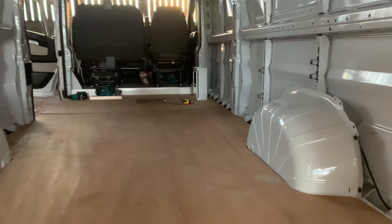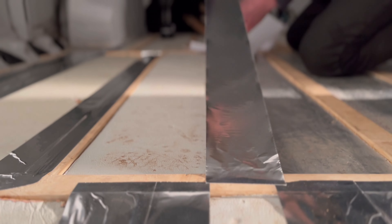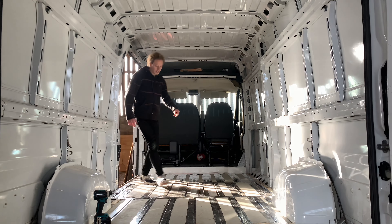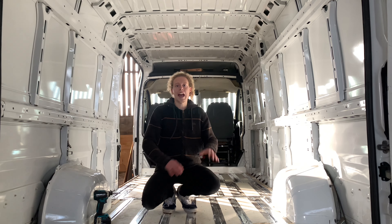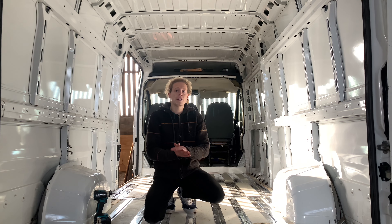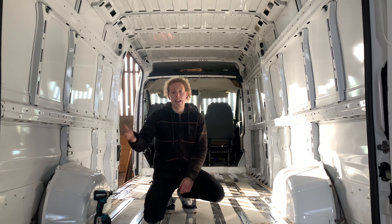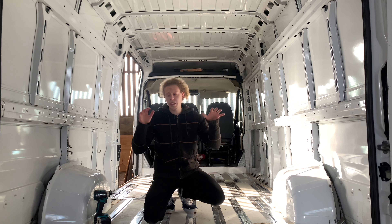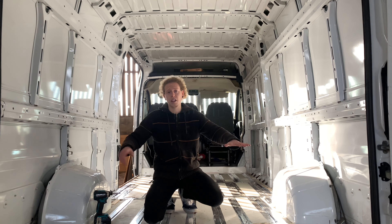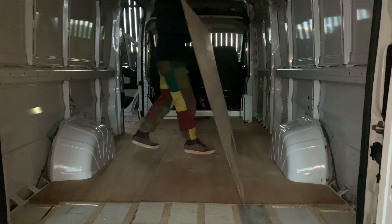Everything looked really good. Now that we knew it all fits, it was time to pull it back up and fit our aluminium tape - check out our video called 'Insulating Your Floor' on our channel. We've now finished putting down the aluminium tape and it's gone really well. The next step is to put down our floor. A friend gave us loads of ply - it's all 6mm - so when it came to profiling, we profiled the first sheet and then duplicated it, placing it on top of another sheet and tracing around it, giving us two sheets on top of each other making 12mm.